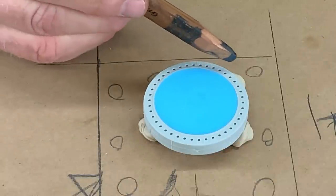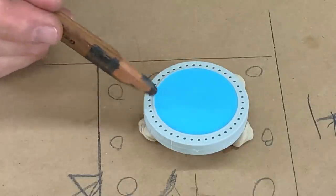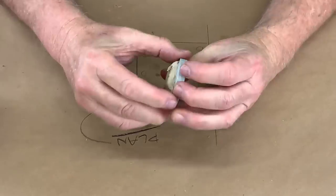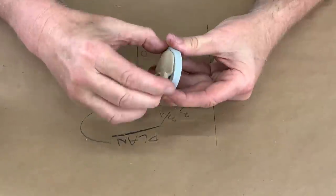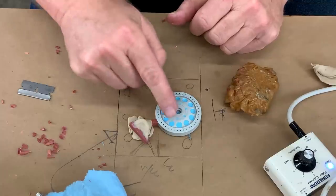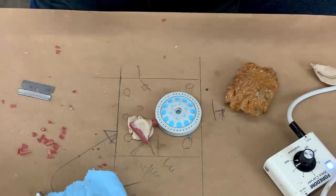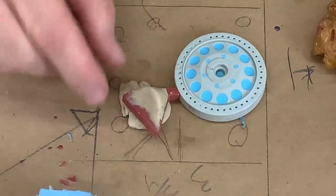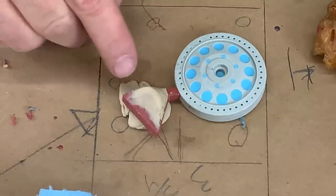They're very shallow but tiny, and we're going to have to figure out how to deal with those next. Remove these little leveling feet, then carefully pry off the clay cookie. I got all the rubber parting lines neatly cleaned up, and I sculpted up a hybrid funnel out of wax and some oil clay.